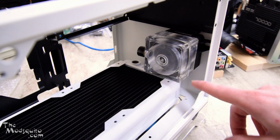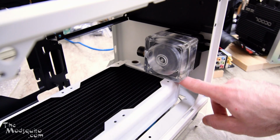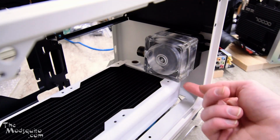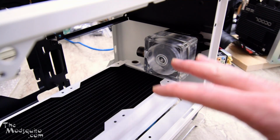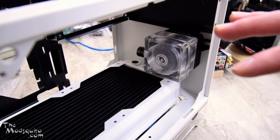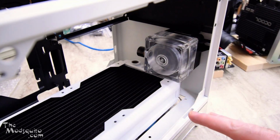And right now I just have a, I think it's a Swiftech SLI fitting, but it's down here between the pump and the radiator. And I added that extra port because the other default port is right here, which isn't very helpful for what I'm trying to do. But anyway, this is one of the plans, or one of the ideas, and it gives me enough room to have the GPUs in here. It's lower than the power supply, which is also good.